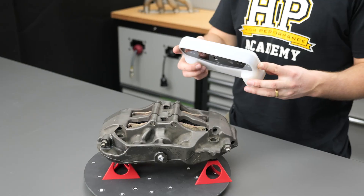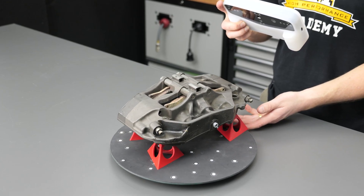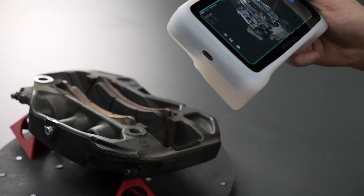To test all of this we took three scans of parts for our project cars. We started with a relatively small scan — AP Racing six-piston brake calipers. Brake calipers have relatively fine features so we want high resolution, especially for capturing around the edges of the brake pads so we can line them up with the edge of the brake disc in our CAD software, and also around the mounting holes if we want to design some brake caliper brackets. When taking the scan in HD mode, I was quite surprised with how close you need to hold the scanner to the object. Even though the scanner tracks really well, it does take quite a lot of time to collect the data with such a small capture field. I bumped the resolution up from its default setting, so the processing time to take data from the point cloud to generating the mesh does take a hit, especially when capturing color texture — it can take anywhere from 20 to 60 minutes for a part about this size.